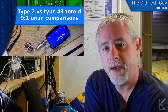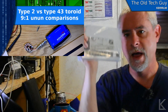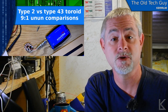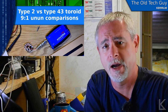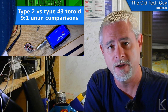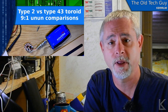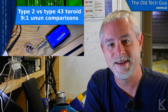I think I'm done playing around with the un-un for now. I've got other things I want to do — for example, I got a bunch of thick-film resistors in, 400-ohm rated at 20 watts. What I want to do is build a terminated folded dipole. When I built the 40-meter folded dipole, a lot of people commented that folded dipoles should have a terminating resistor on the far end — well, that's a different antenna, a terminated folded dipole. I'm going to convert the 40-meter folded dipole into a terminated folded dipole and give it a real good look. I've been wanting to get away from antenna videos for a while, but I'm having fun experimenting so I'll just keep doing it.